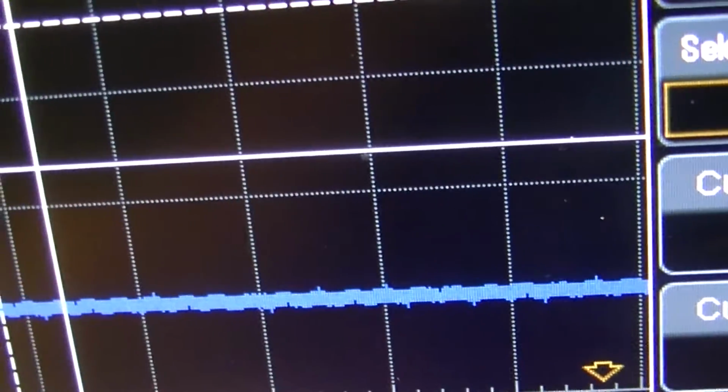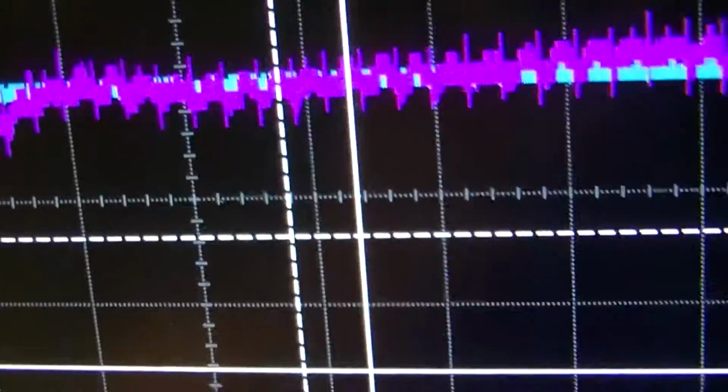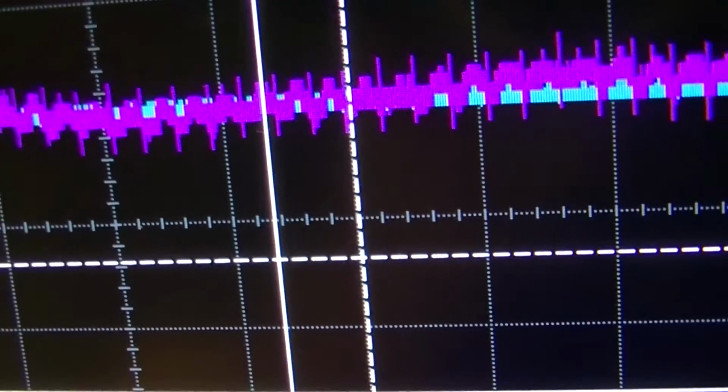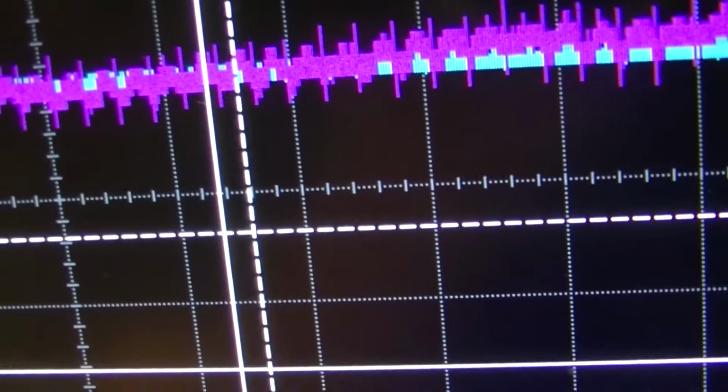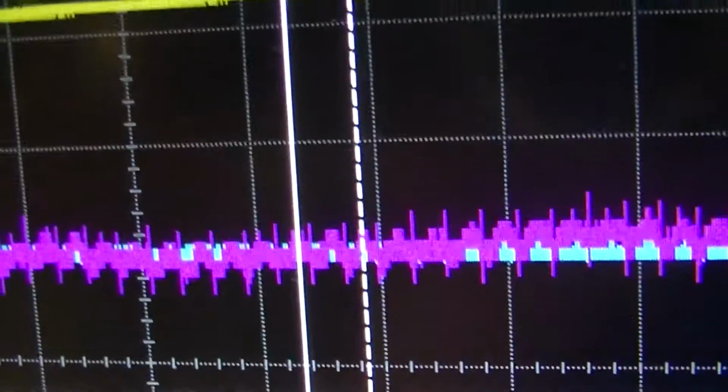Judging by the oscillations I saw in there, so you can see what I'm doing. Oscillations look to be a little bit unstable, but that's kind of to be expected. I think these employ either a Royer or a ring oscillator, can't recall correctly. I recall hearing things about them using Royer oscillators, but you don't tend to see those on 120 volts. I think with the transistors they use, they can get away with it.